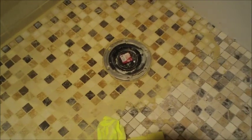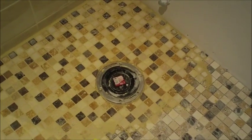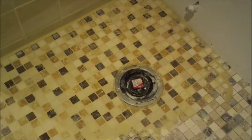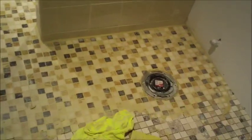Coming out of the shower — this ring hasn't been set yet, so I'm trying to keep the grout kind of clear around there, which is fine, because there might come a day that it has to be lifted up and that ring's got to be changed out. Toilet flanges go bad all the time; the toilet loses its anchoring ability with the two small bolts and before you know it you need to get the old flange out. I certainly don't want to have to chip it out. I've been wiping here as I've been going along — it's gone really good. We're about halfway done.